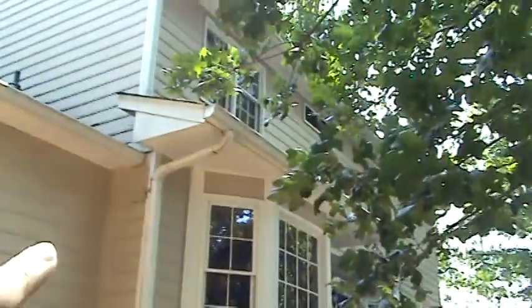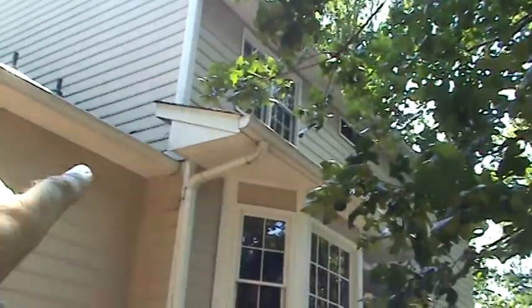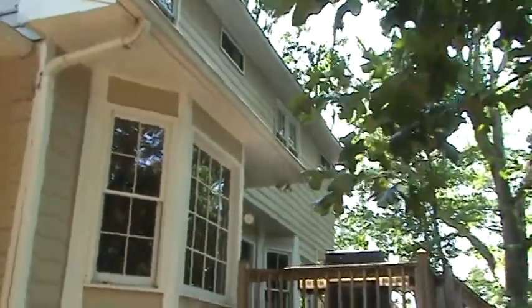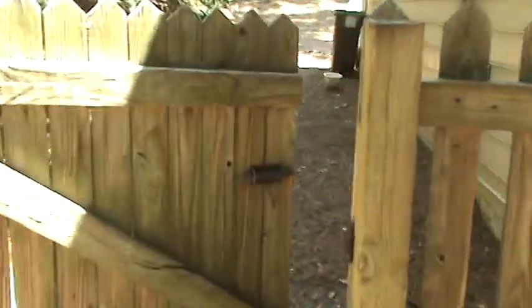She's got a similar issue with this gutter right here — the downspout is clogged and the upper roof line is feeding into this small gutter, so it's probably clogged with debris. It's been several days since it rained and you can see a puddle on her deck where water is dripping out the back end of that gutter. If she doesn't get after it, it's going to rot out all this area. We've been doing this stuff a lot of years — 25 years in metro Atlanta. I'm a fourth generation contractor; my brother and I have been running this company a long time. We're definitely not the cheapest, but we're pretty good at what we do, and our work is bar none — we do great work and we stand behind it.